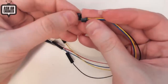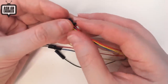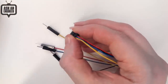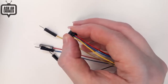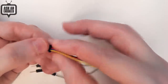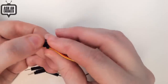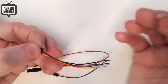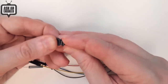Someone in the chat had asked, how does it work with Grove? Well, Qwiic is not directly compatible with Grove. You have to be careful because Grove is 5 volts and Qwiic is 3 volts. So just make sure that if you're using a device, it's not... And what about Stemma? How does Stemma work with Grove? Stemma is actually more like Grove, which is it provides 3 to 5 volts, but it accepts either one. Okay. We'll make a diagram at some point to explain this. We will, because it is a little confusing.